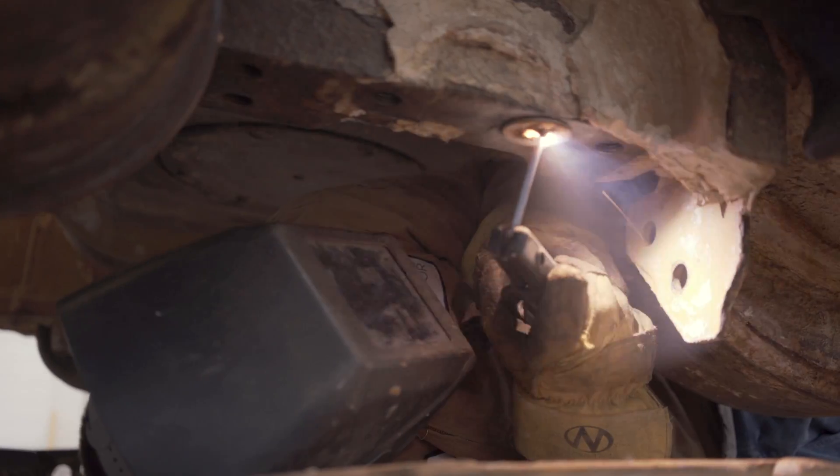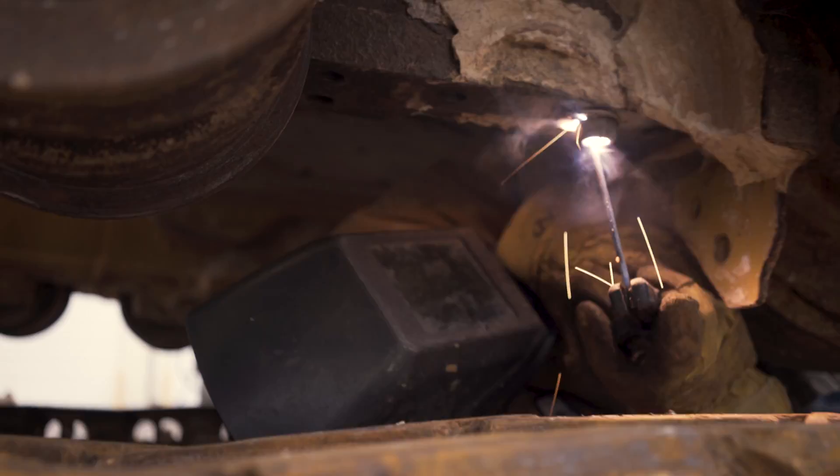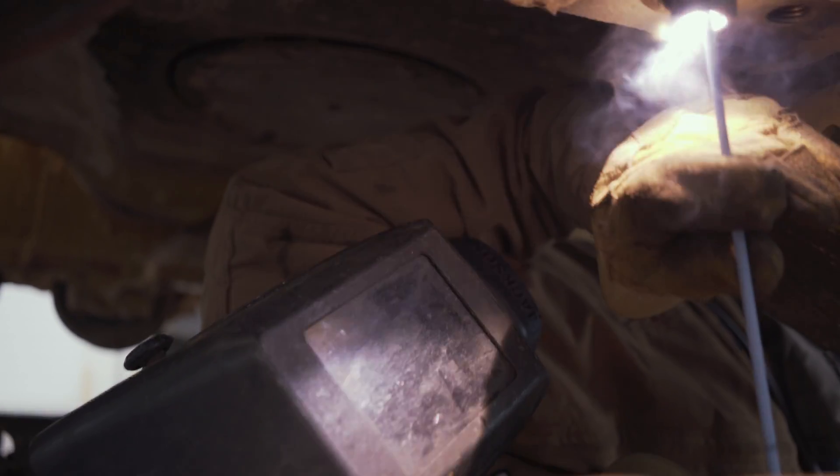Start in the center of it, just kind of fill it all the way out and bring it down, then weld a washer on top of it. We're going to take a nut and tack it on each side, then fill from the washer in through the inside of that nut. And we'll be backing that bolt out.